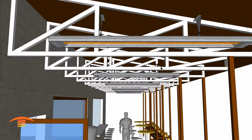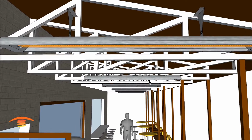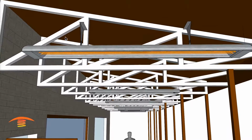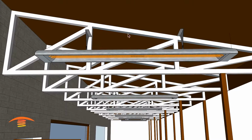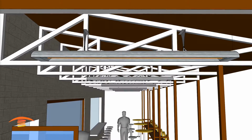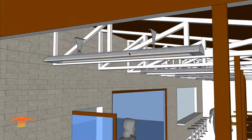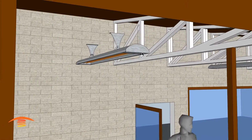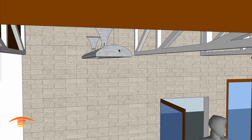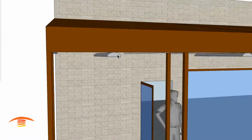So yeah, there should be a tubular steel going down from here all the way down, here all the way down, and then you could run a bar from those two across this way, and then maybe put a little L bracket onto it and allow it just to hang from that bracket. But you do want to have something where you can mount to, obviously, and you don't want this pressed up against the steel itself, so that's why I have that elevation the way I do.